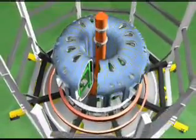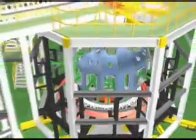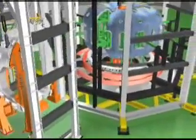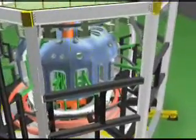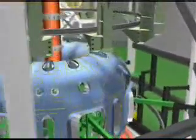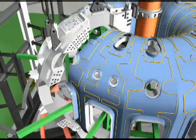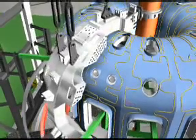Once the vacuum vessel is positioned and the main jig is reassembled, the TF magnet is assembled, which is the highlight of K-Star assembly. The TF magnet is passed through the 22.5 degree gap by two TF transfer vehicles, positioned on the Hillman roller, and rotated to the opposite of the input position.